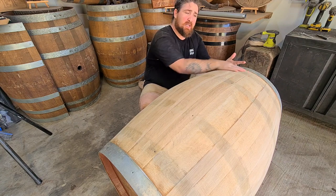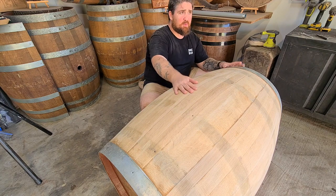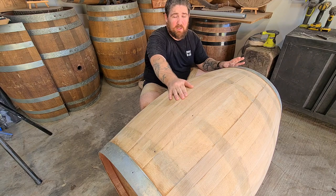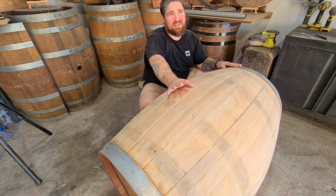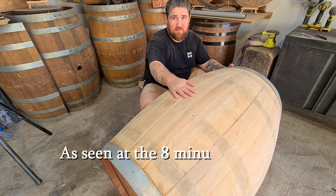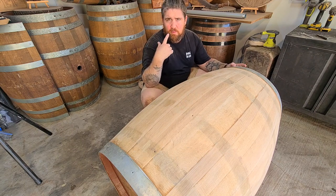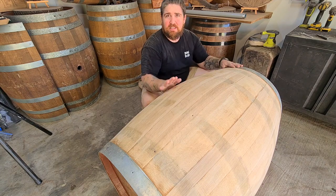But what I'll do along the top edge here is I'll run the rotary sander along the top, because I think with the angle grinder and the sanding disc, what can happen is when they start to touch and go from wood to steel, there's a good chance that the sanding disc will explode and rip into pieces, which I'm sure I've got on video, which I'll definitely add into the video in slow motion so you can see how fast they come out. And if you wonder why my face is red, it's because I'm wearing that bloody mask and it's really hot down in the shed at the moment, so safety first, eh?